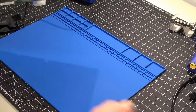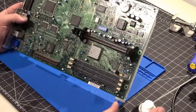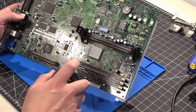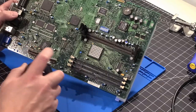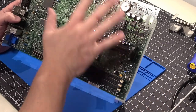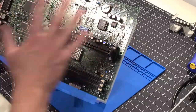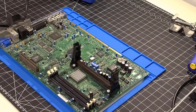One thing I like to do is spray a little contact cleaner in the expansion slots. This is safe for electronics and cleans out any dirt and grime where contacts would be. It dissipates really quickly. There were no issues with the slots that I could tell — the problem was with the capacitors — but as a precaution while it's already out, I'll clean up all the contacts. Good to go. Now I'll clean up the workspace and the next step is putting the motherboard back in.